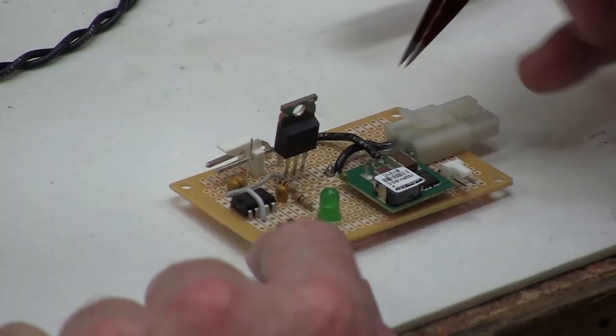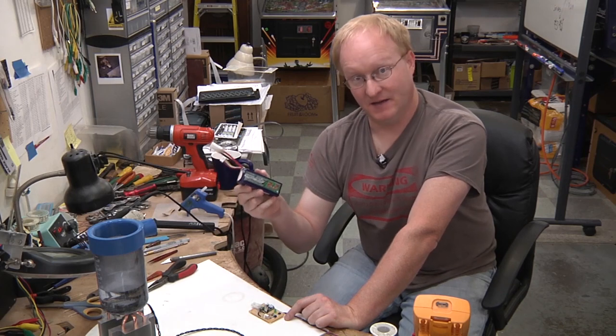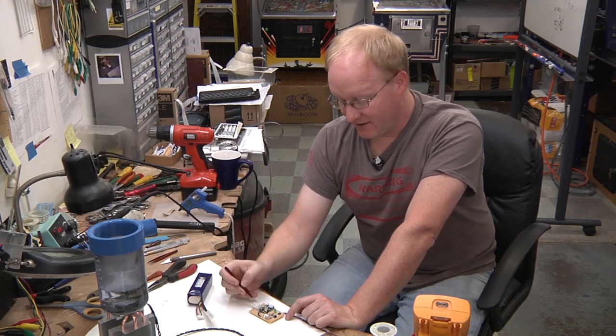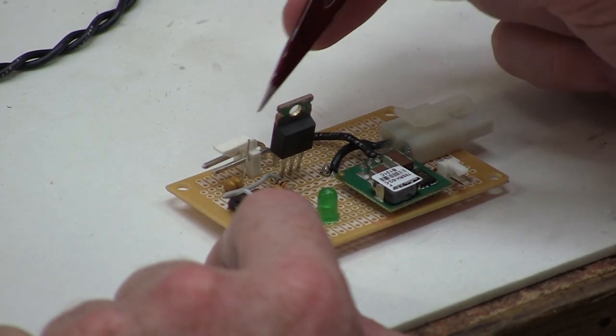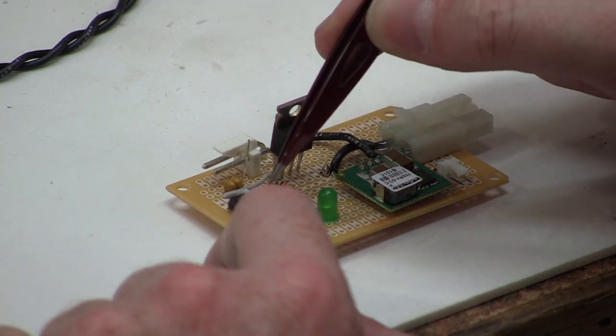Let's go over the circuit that I wired for the camping chair. The voltage comes in here, and we're gonna use this hobbyist battery. This is meant for a quadcopter. We just had it laying around. Voltage comes in here and it goes into the Peltier, which then is returned here into the MOSFET. The MOSFET is controlled by this 555 PWM circuit. I can give you an example of that now.